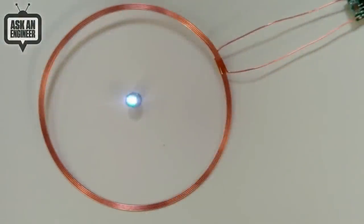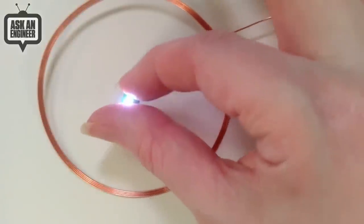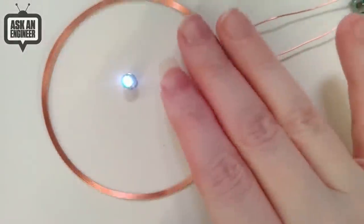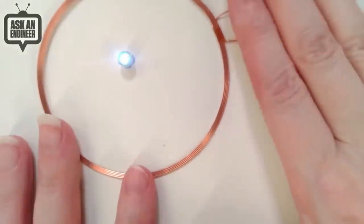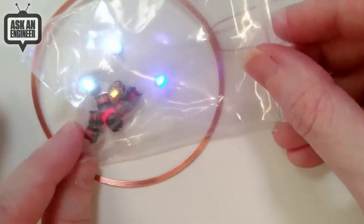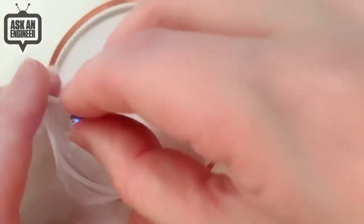This is really cool and is often used for models, LEGO-like bricks, or 3D-printed things where you don't want to wire up an LED or can't because it has to be embedded somewhere too thin and small for a battery pack. You can have a coil underneath that lights it up from below. It's also great for arts and crafts, sewing, or wearables where you don't want wires. You power the external coil with five volts, get a bunch of LEDs in different colors — red, yellow, green, blue — and two of each of these little receiving coils.